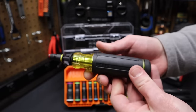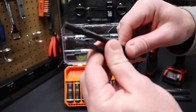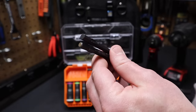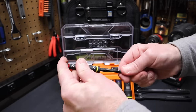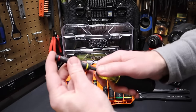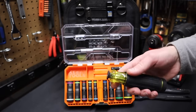You might be wondering if this is compatible with Klein's 14-in-one adjustable screwdriver — which has the 12 bits in the carousel — or Klein's 20-in-one, which are all very similar. They have this shank inside them. I'm going to take off the flip bit on the end and compare them. You'll see there is no magnet on the one that comes with this deep-well flip bit set, which makes sense because they're deep-well sockets. There is a magnet on the Klein 14-in-one. Otherwise they have the same spline design with these corners on it. So I can pop that on there, put it on the 14-in-one — it fits. I can also take this shorter extension, pop it in here, and it works in the 14-in-one handle too. It clicks right into place — you can see there's some space for it to clear at the base of the collar. So it does work with the 14-in-one. Nice to see this interoperability between Klein tools.